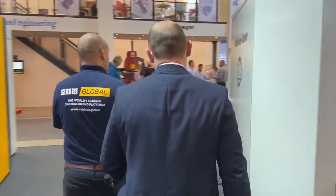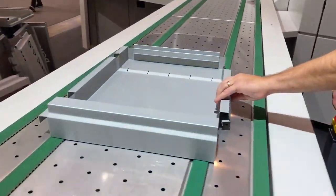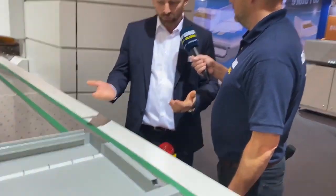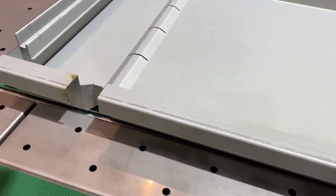Let's walk around and look at the finished product. This is what we've just made — this is the finished part. If you imagine doing this without the automation, there are dozens and dozens of operations, dozens of times moving the sheet around for different folds. How much time do you think the saving is? It depends which kind of machine you choose. We have semi-automatic machines where you have to act at every step. There are approximately 40 bending steps and cycles for this part. You can save approximately 15 minutes compared to other machines — at least.